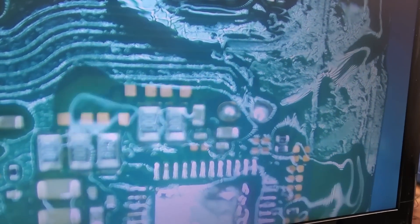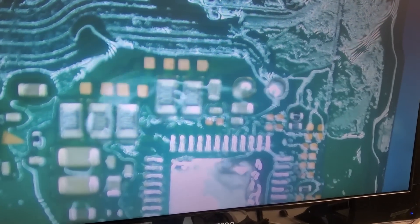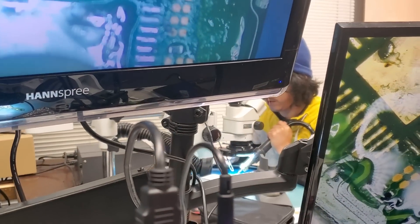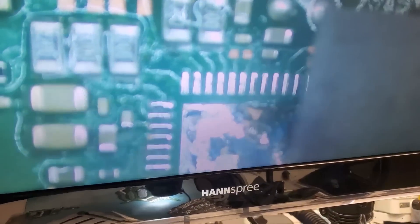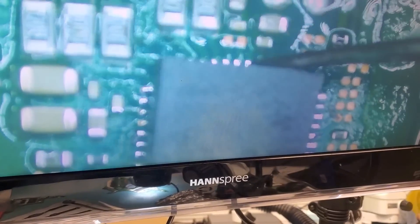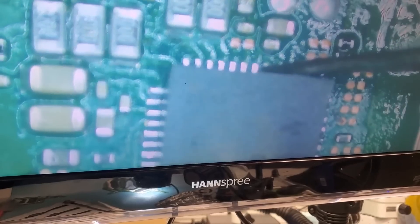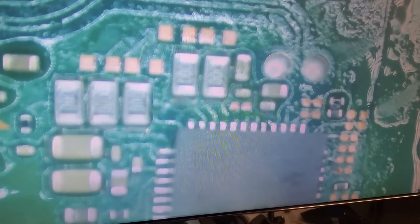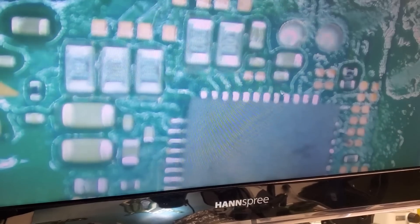We want to see how Angel is going to do with this QFN chip. Solder liquefied — I can tell by the metal pad. Very gentle, just try to center it as much as possible and let go. Do not go up and down, left or right — you do not want to knock off the neighboring components. Now apply hot air. We want to use surface tension; we want that chip to align itself. Use hot air and tap it a bit from the right.